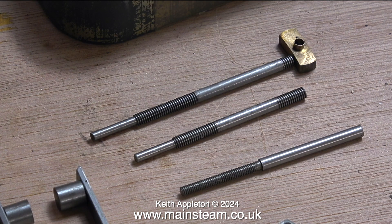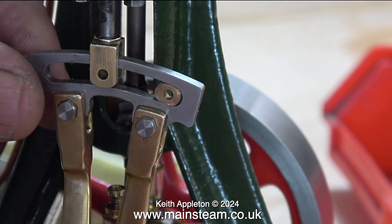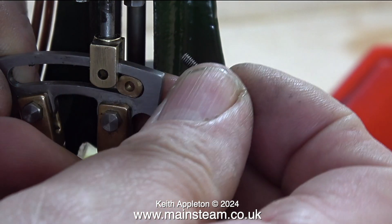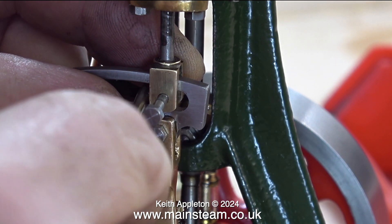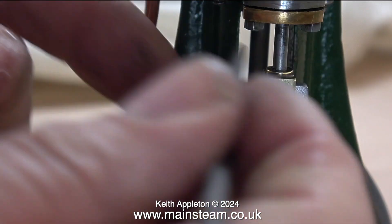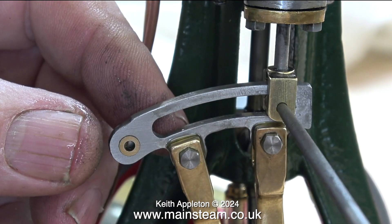In the first episode I showed a collection of parts from the tin, and in the top right of the picture is the basic piece of metal that's going to be trimmed to be the die block. I carefully trimmed it to the right size using my one-inch belt sander, as it's far too long in its original state. Here you can see it in position once trimmed. It's always a good idea to make sure the die block is not too long and doesn't hit the internal part of the expansion link. I'm using a needle file to centralize the die block so I can put the bolt in.